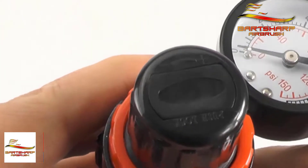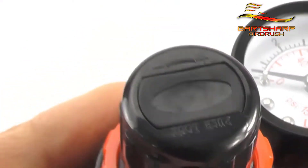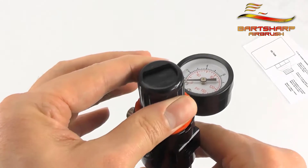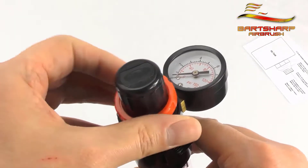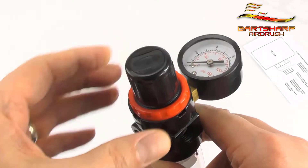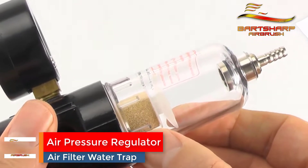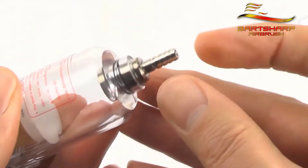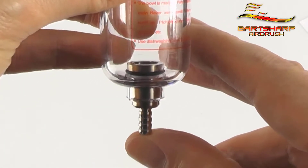Let's have a closer look at this pressure control dial. You can see a negative and a positive — negative is to reduce pressure, positive to increase pressure. When adjusting the air pressure you must lift this control dial, and when you've set your air pressure just push the dial back down. As for this red collar, watch to the end of the video and I'll show you — it's useful, it just isn't that exciting. The clear section of the pressure regulator has a micro filter that traps airborne contaminants and water vapour. There's a spring-loaded pin — press it and it will release any accumulated water vapour, and if you've got air in your tank it'll also release air.